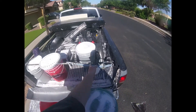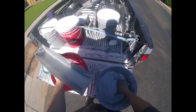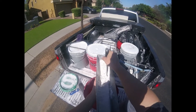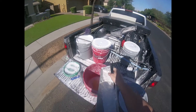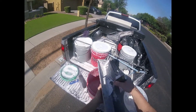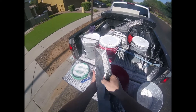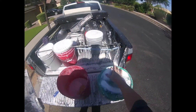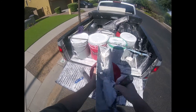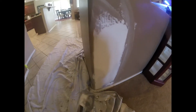I like to work with five-minute muds because they're easy to work with, but you can't let them set up and dry. They're not like regular joint compound where you let it dry overnight and then sand it. You have to work with these materials as they're setting up, using the sponge and six-inch knife slick-out technique. My extra mud just sets up like a rock and goes in the trash. I always use my 12-inch knife — just stick with a 6-inch and maybe a 10 or 12-inch knife.